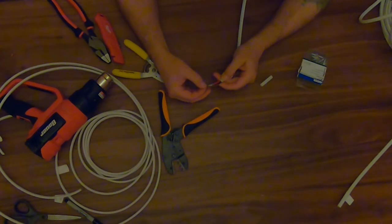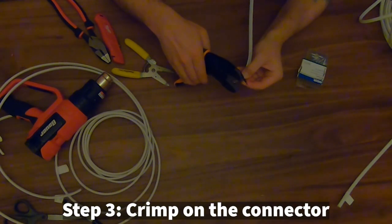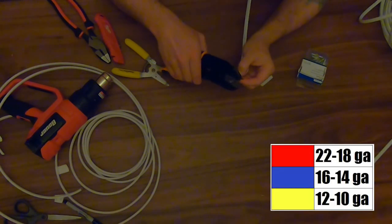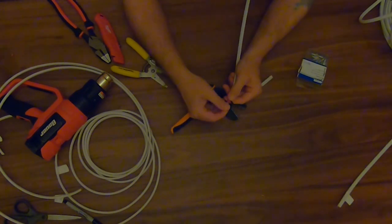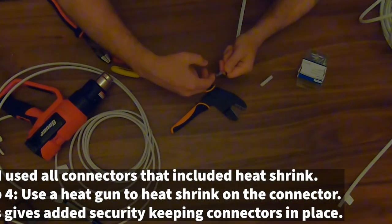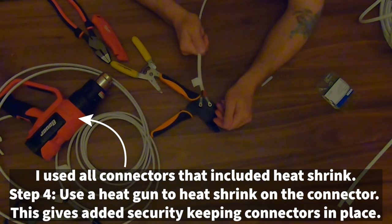Once you have the wire exposed, enter it into the wire connector and using a crimp tool, select the corresponding gauge and crimp down. Most connectors are color coordinated - I select blue for my connectors. After crimping, check the connection is solid by doing a pull test. If it holds, you have a wire ready for its application. Continue on with the rest of your connectors.